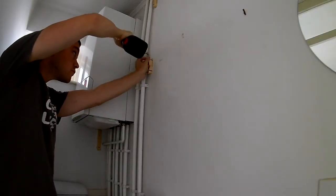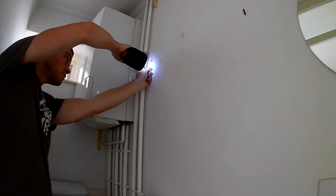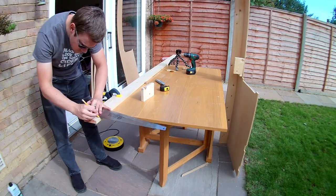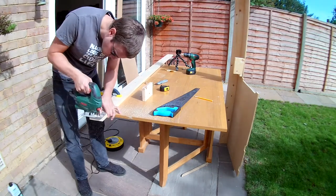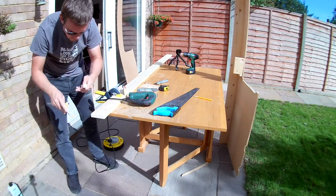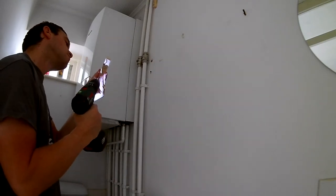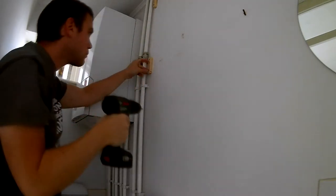Remember I mentioned a split bracket? Well, I needed to remove and replace that. With both ends split, it wouldn't hold onto the wall well enough for my satisfaction. It was quick and easy to remove, and then it was time to start cutting the plank again. The exact size of these pieces doesn't matter as long as it's about 2x2cm, so I drew lines for three of them rather than re-measuring after losing a millimetre or so to the jigsaw blade. Cutting pine was much nicer than cutting MDF. The edges are a bit splintery after cutting, so I sanded them all smooth before using them. I think I'd like to get a belt sander to make this easier in the future. Frustratingly, as I was fitting the block it split again, but I decided it was held well enough that I wasn't going to worry about it.